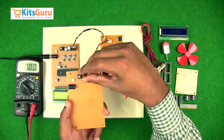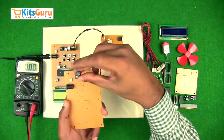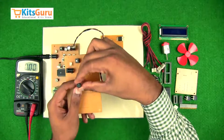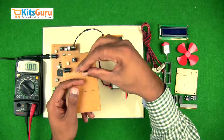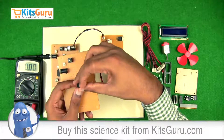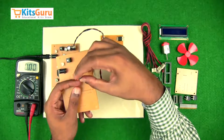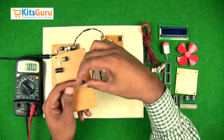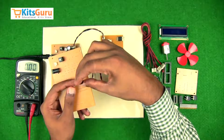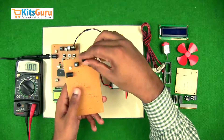There is a bridge rectifier, which converts AC input into DC output. If you are giving input through a transformer power supply, this bridge rectifier will convert that into a DC output. Looking at the bridge rectifier, there are basically four terminals. On top of the terminals there are symbols: the two AC symbols represent the AC input, and the positive and negative symbols represent the DC output. The positive terminal has the longest stem, so while inserting the bridge rectifier we need to ensure the positive terminal is on the top right.